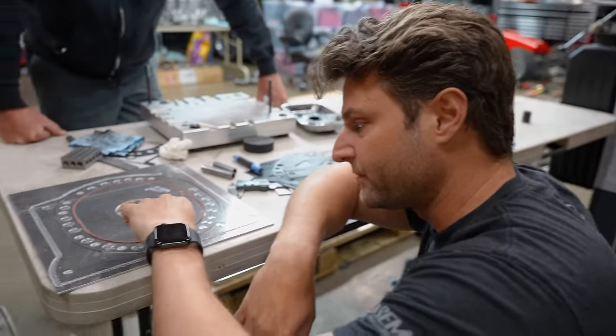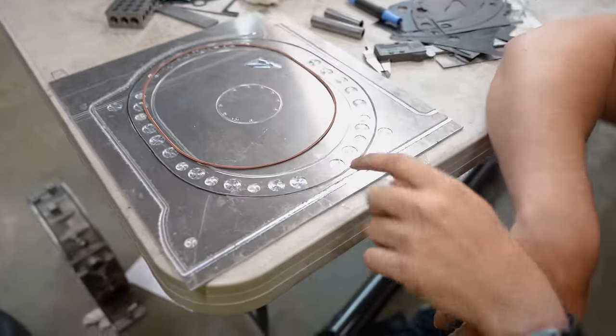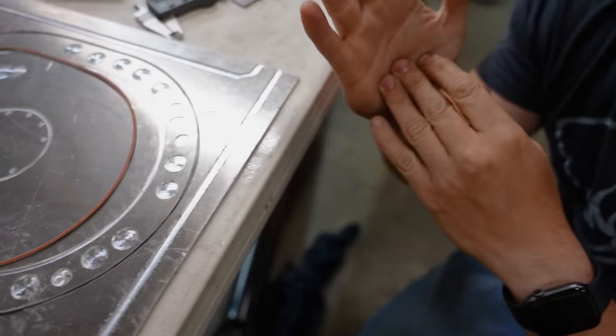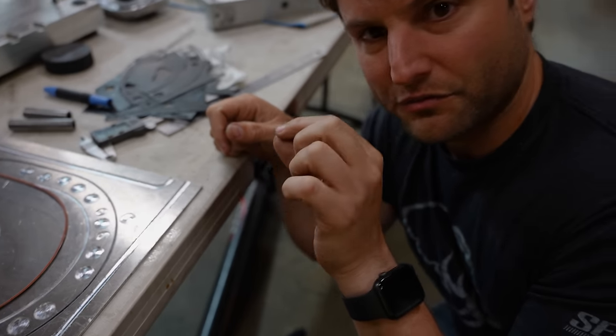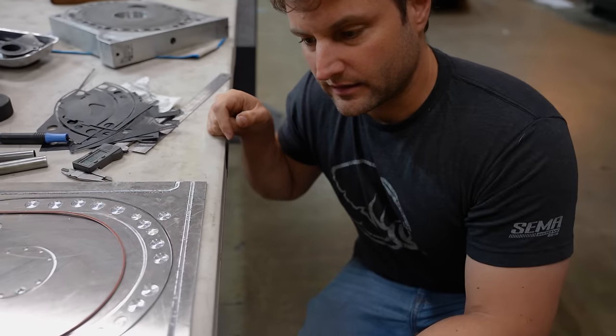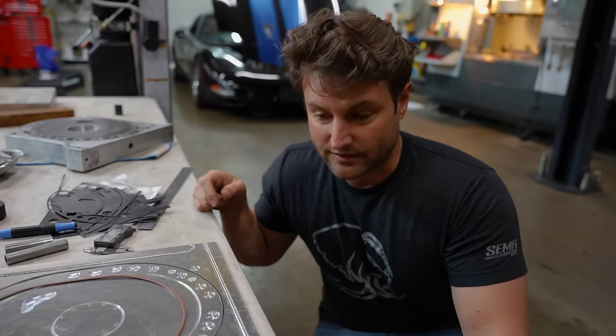So for example, the control rings on our irons are sharp in the bottom corners, a 90 degree flat cut. We're going to go get tools that have a real nice bull nose, like an edge with a real small radius on it, so that we're not creating any stress points on these plates. We're just going to do it to the best of our abilities.